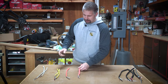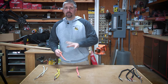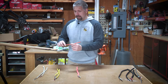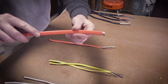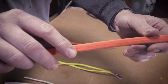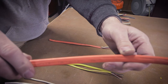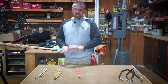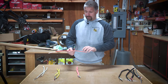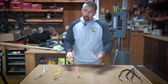Just so you can take note — on any type of especially newer Romex, you can look on the jacket and tell the date the wire was made. This one was made October 18th of 2019. That's a nice reference for inspectors, electricians, or anybody — you can see when this wire was made and how old it is.